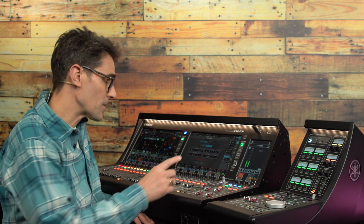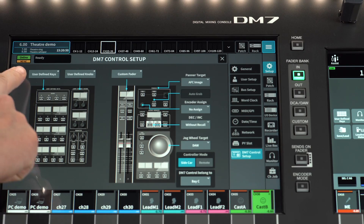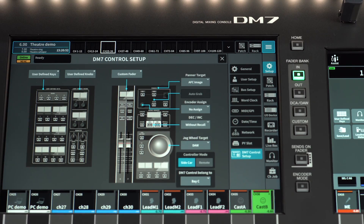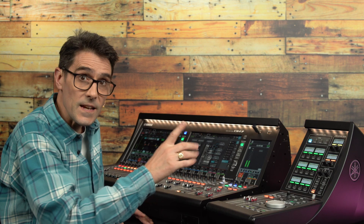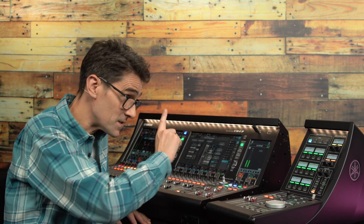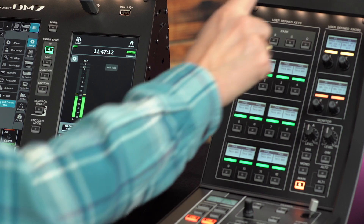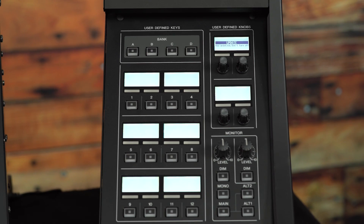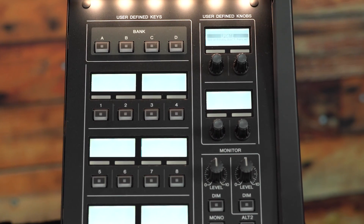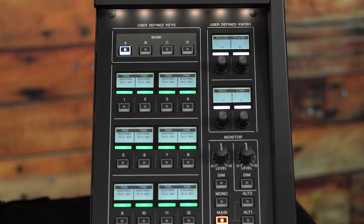Now on the console, take a look at the DM7 Control setup screen. At the top left you will see the status of the power supplies and whether firmware is being transferred. If that is the case, wait a few minutes for it to complete. DM7 Control will also display the update status, then it will automatically restart and synchronize and it will be ready to use.